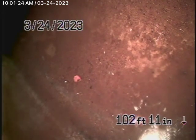So what I can tell you is that we're running our camera from a 3-inch clean out located on the left-hand side of the house. At the end of the driveway in a little crawl space, there's a clean out. And we did meet the plumber over here. He was here when we got here. He said that he replaced all the piping under the 2 bathrooms up to the kitchen where he tied into the old cast iron pipe.